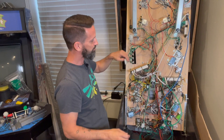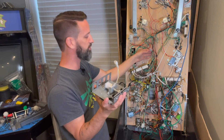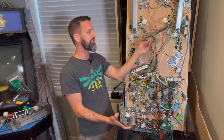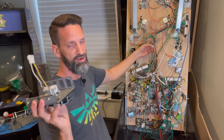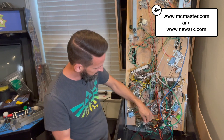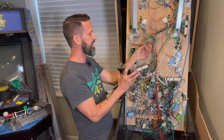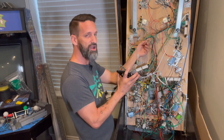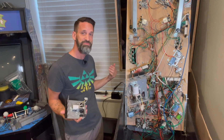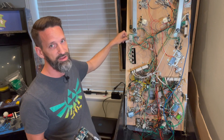So here on our header: I've got red for my five-volt, black for ground, the switch inputs, and then for the STB pin another black wire going to ground back into my IO board. On the other side I really like this nice quick-disconnect for the coil — it's a normal high-power coil, no diode on this one, but there's never any hold power so it'll work just fine; we don't need to add a diode. I found a similar matching connector off McMaster-Carr — I'll put the link on screen. I've been using those for the harnesses on my upper playfields: 12-pin, 9-pin, and this 3-pin connector — the right size, with the plastic receptacles plus the pins and sockets you crimp onto your wires.